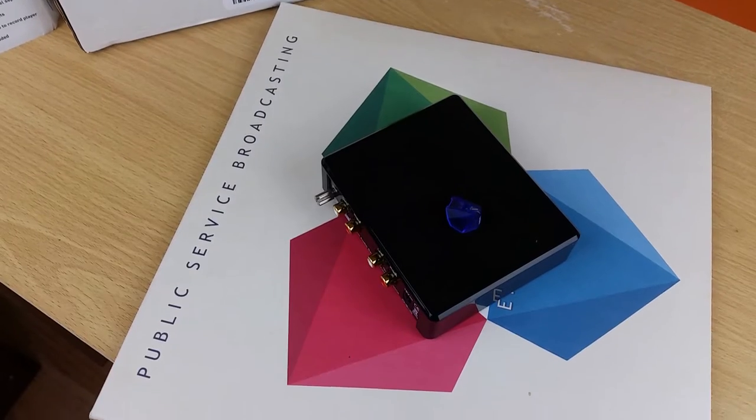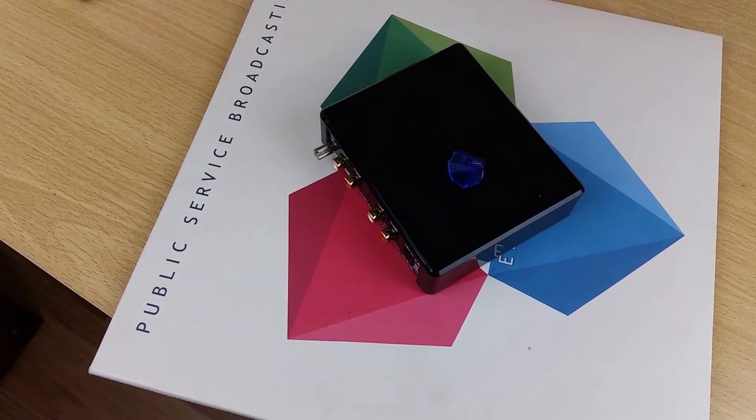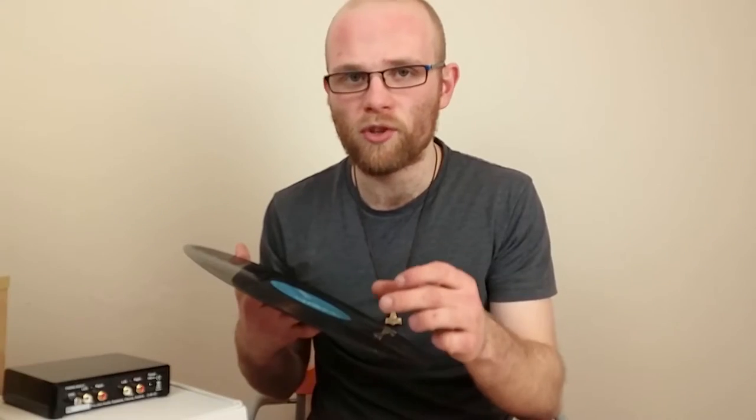Squashing all that musical information onto an LP takes a lot of space, which is obviously rather limited. Bass in particular takes up tons of width. So by cutting or de-emphasizing the bass and boosting the treble in the mastering process, it's possible to reduce the size of the grooves quite dramatically. When it then comes to playback and you're about to drop your needle, the phonostage does the opposite — it boosts the bass and cuts the treble. The end result being that, in theory, the signal the mastering engineer had when he cut that record is the same thing you should hear.